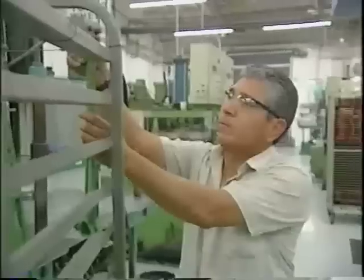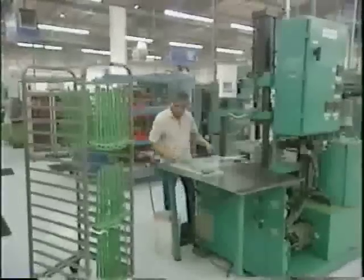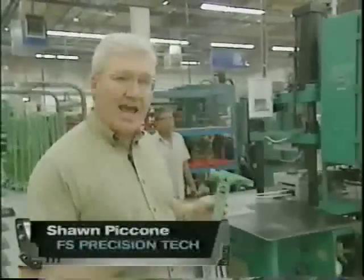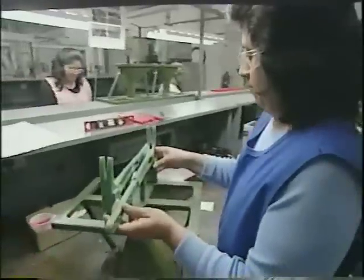These space-age hammers are made at FS Precision Tech in Los Angeles, and it doesn't happen overnight. They use a multi-step process called investment casting. For every single titanium hammer that's made, a wax hammer is formed first using an injection press — taking a negative cavity mold, injecting liquid wax into it, and getting an exact replica of what they're trying to produce in metal.